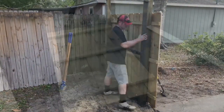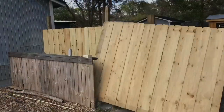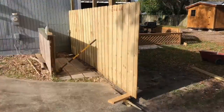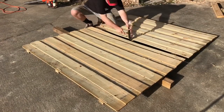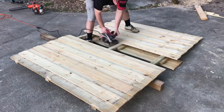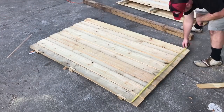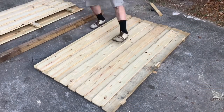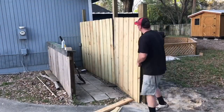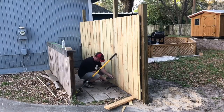As I installed the second fence panel, I realized I got to cut it down to size. A simple circular saw does the trick very nicely. One of the pickets got damaged, so I replaced it with some extras from the home store. The pre-made panel had to be cut down to size — I find it easier to remove some pickets from the middle, put a little support board underneath, and cut it with a circular saw. This one took about two extra pickets, and we were in business. Keeping on with the board-on-board theme, I put it in place, leveled it, and drove it home.